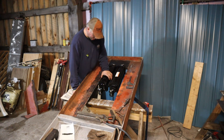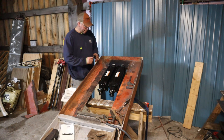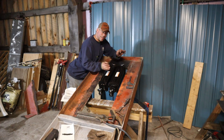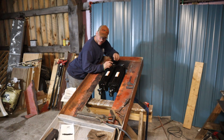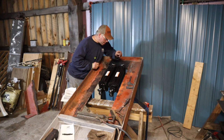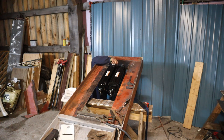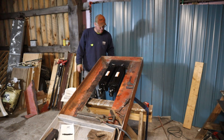Look at that sexy piece right there — holy cow, I like that. That is absolutely beautiful. Now, these do have to work in tandem with each other. They have to work the same, so these things have to be perfectly parallel to each other while they're pushing down. Otherwise it's going to spring, things are going to move funny, and it's going to make everything go down awkward. We don't want awkward — we want this to be smooth. I also have an old restaurant cutting board that would make a good wear plate to keep that top die on track. I've been racking my brain on how I want to do it, but I think I have some ideas. Almost starting to look like a press, isn't it? Can't wait to have it all painted and shiny and nice.